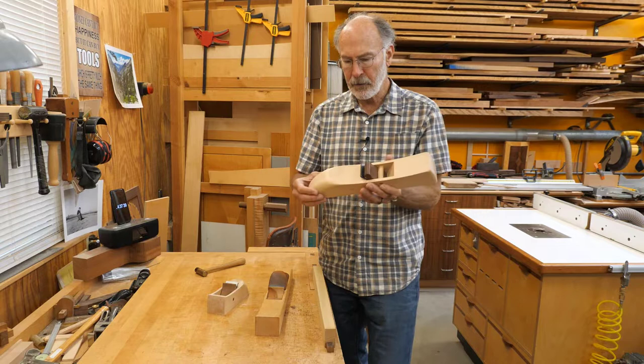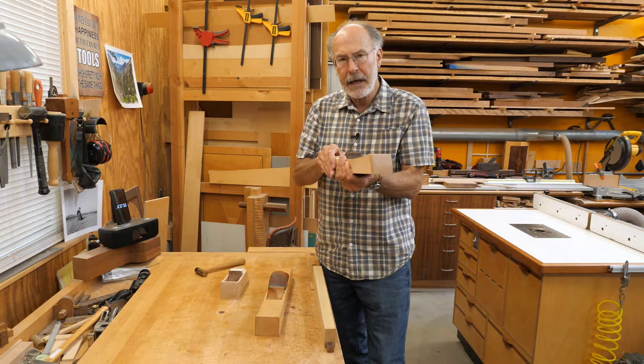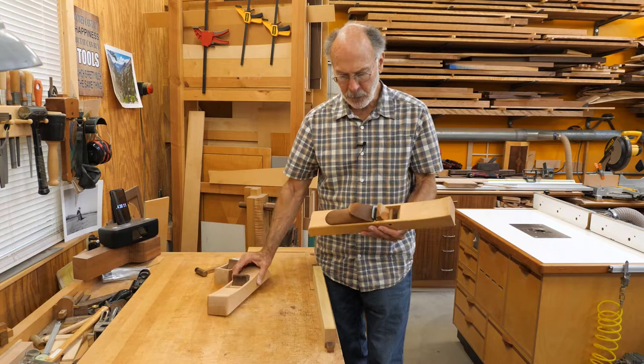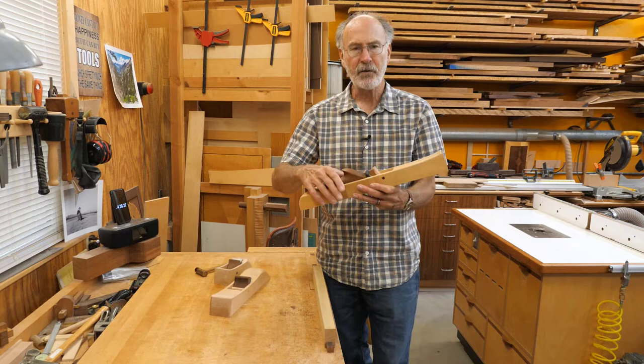Because I want to move my hand a little further forward, I've flattened this curve much more than the shorter plane, and it doesn't allow me to push as well — I have to grip it tighter in order to push it, as opposed to just pushing. So for this longer plane I didn't want to have to grab it way in the back, so I made this handle so I can grab it closer to the blade. This makes for a very comfortable and efficient way to use the plane.